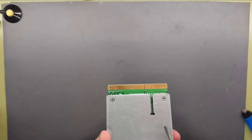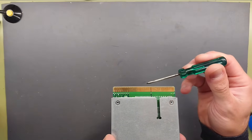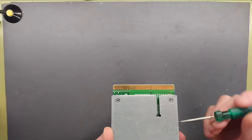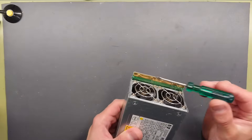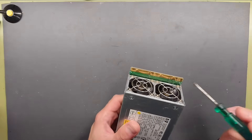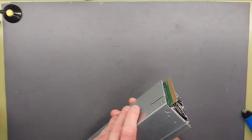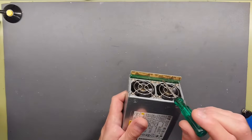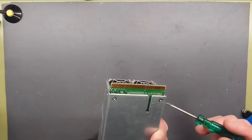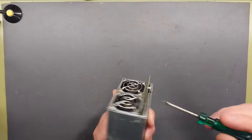What you can notice about these large power pads is that the large one that extends the furthest out is usually the negative rail. You could also measure with a multimeter between this rail and the casing, as it would be grounded. If you want to mount some kind of socket — like a banana plug, some pin connectors, or other terminals — it is important that you do not drill holes through here, as this is a four-layer board. You risk short-circuiting the positive and negative rail against each other or against other parts of the circuit. So do not drill here, but if you need a high-current output connection, solder your wires to both sides.